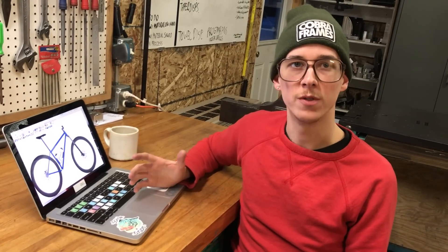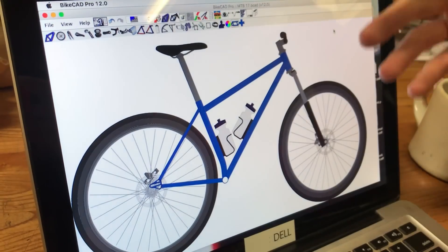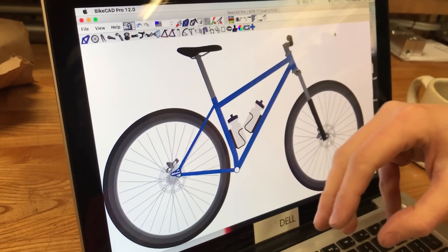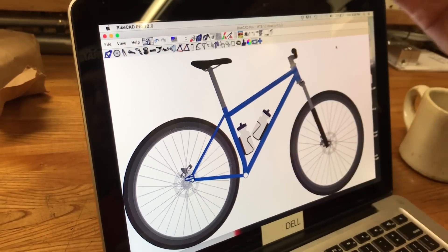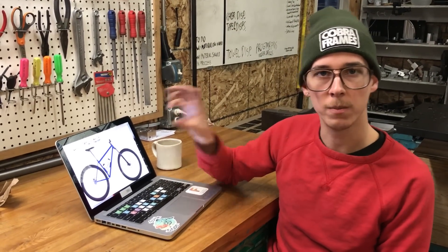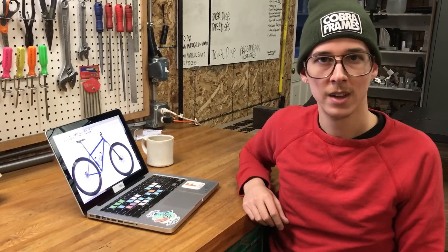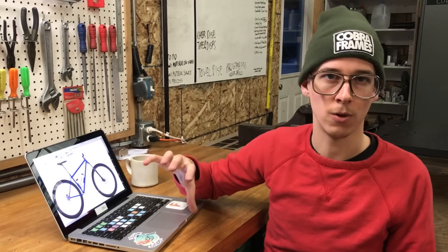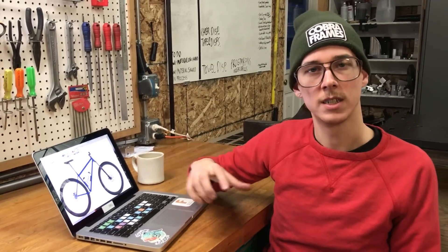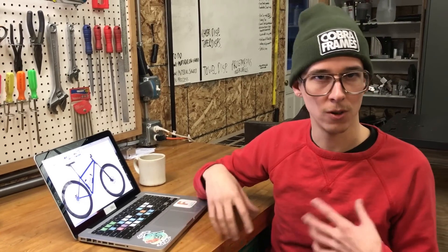One of the many valuable features is you can lay out fenders, racks, and water bottle cages. Every bike I've made has had water bottle mounts, and depending on your school of thought, if you want a low center of gravity you want those bottles as low as possible, or on an adventure bike you want room for a frame bag and need those bottles placed just right. Being able to model that up tells you where to drill the holes. It's a lot easier to drill those holes before you weld the front triangle together — no need for a right-angle drill, and no chips rattling inside the frame for the life of the bike.